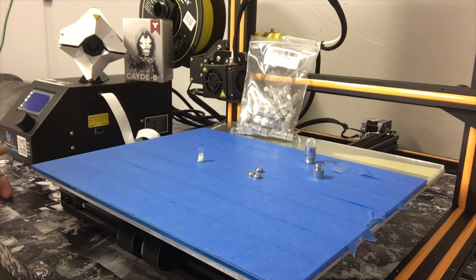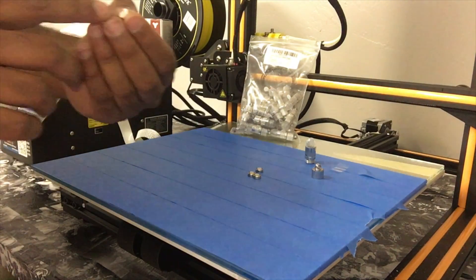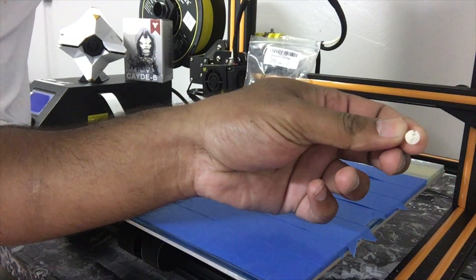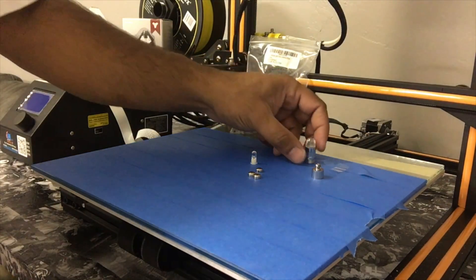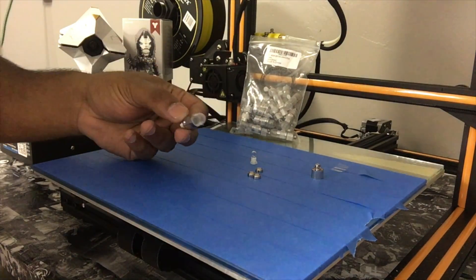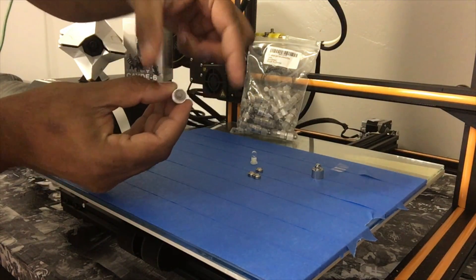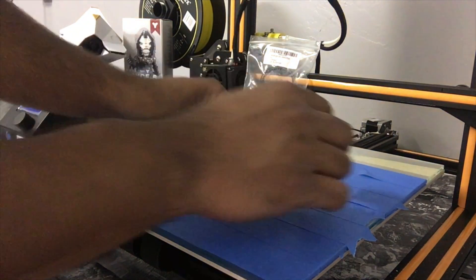Here is your LED right here. If you were to go get LEDs on your own from Radio Shack or somewhere, you'd get something like this with wires that come out — there are still metal leads in there and you can solder these onto your power, which you can take off the printer itself since it doesn't take too much battery. If you do want to use this part, I recommend getting light sandpaper, about 120 grit or smaller. Just rub it on the sandpaper like so — that's going to rough this part out so instead of the LED shooting straight out, it'll disperse the light to give you more range.